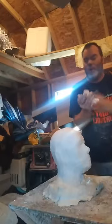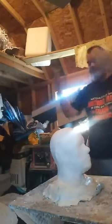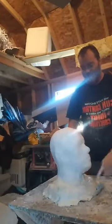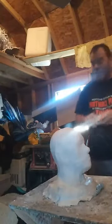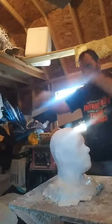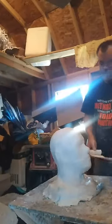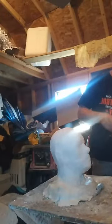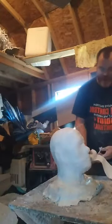But they do work wonderfully for, like, I got wall hangers I want to do. And I've cut them into different, like, smaller pieces. So what I do is, I put the smaller piece in a mold, put it in the rotocaster, turn it on, because they have to be hollow. When you're molding resin, trust me, you want hollow pieces. Because resin is very heavy.